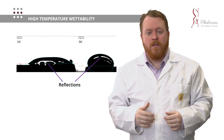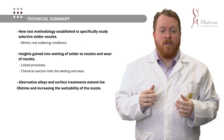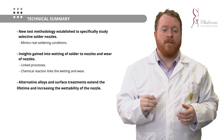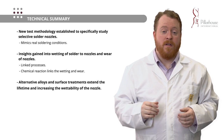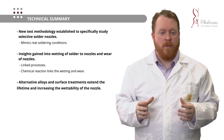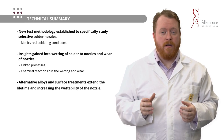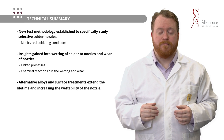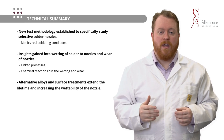Now let's move on to the technical summary. We've been able to determine a new methodology to analyze the wear of selective soldering nozzles that mimics real-life selective solder nozzle usage. We've been able to determine some links between wettability and wear, and given initial insights into the reactions and chemistry that underpins the wetting, wear, spreading of solder, and possible formation of reaction layers and intermetallics. This is to be studied further — there is currently a PhD project in progress looking at this — and finally we've been able to determine new materials and surface modifications to extend the lifetime and improve the wettability of these nozzles.